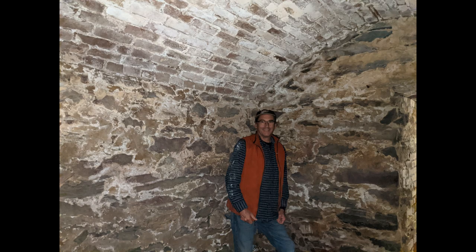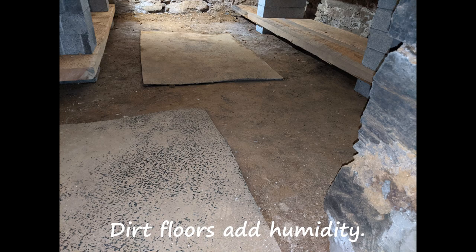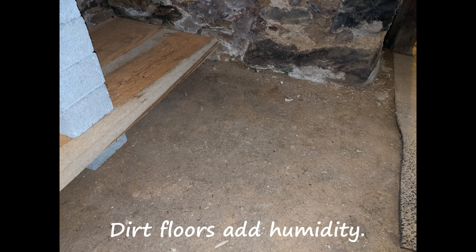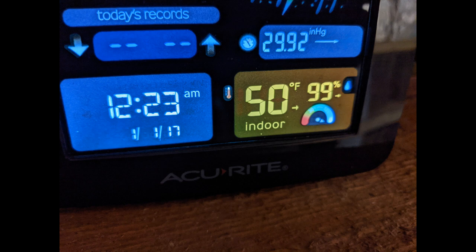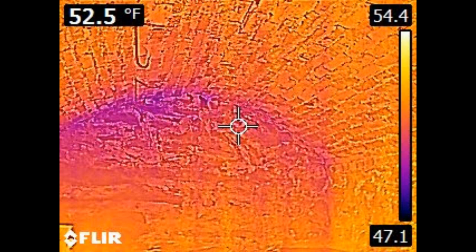Now that the project is finished, we're constantly monitoring the temperature and humidity in the root cellar. The humidity is even higher now that the air does not mix with the basement — we're typically in the high 90s. Temperatures range from about 50 to 55 degrees. We'd love to have it maybe another five degrees cooler — that's the last part of the project we haven't figured out yet. I'd love input from anyone with experience doing ventilation systems for root cellars. I was fortunate to get a thermal imaging camera to look at the temperature. The infrared image shows the purple area is coldest — closest to the ground — while orange is mid-temperature. There's really only a variance of three to maybe four degrees. The bottom line is these builders and designers really knew what they were doing almost 200 years ago.